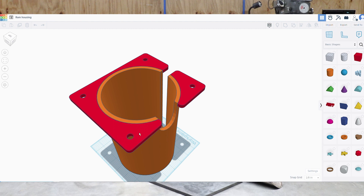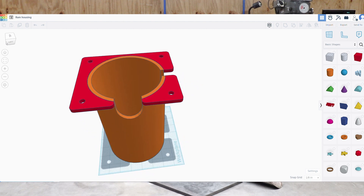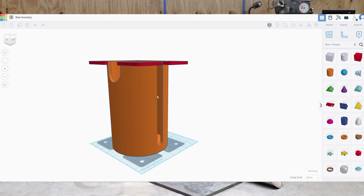I did consider taking a plate and mounting it directly to the ram but I canceled that idea for two reasons. First, if I want to weld this to the ram I'd have to disassemble the ram — I didn't want to go through all that. Also, welding to the ram risks warpage and I don't want to induce a leak into my ram. Additionally, if I welded the mounting plate to the ram, any subsequent service down the road would be complicated — if I needed to replace the ram I'd have to cut this plate off or create a new one and weld it to the new ram. So for serviceability, I decided to make the ram a floating component.